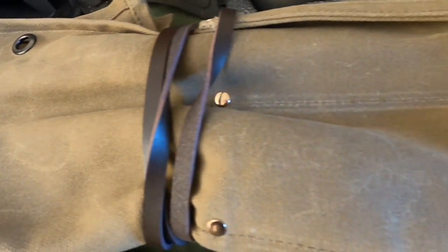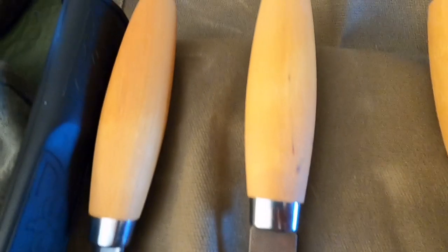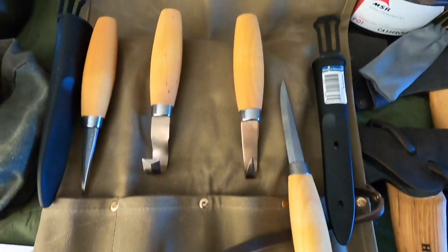I've got this little canvas tool roll here with my carving knives in — I'll get them out now and show you. These are the Mora carving knives. The two hook knives are razor sharp — all these knives come razor sharp. That one is starting to get a bit of patina on it because it's carbon steel; I'll probably get some oil on that. The only problem with carbon steel blades is that they sharpen really well and hold the sharpness well, but if you don't oil them up properly you start to get what looks like rust. Oil it up and it stops it from happening.